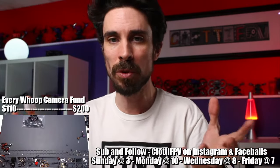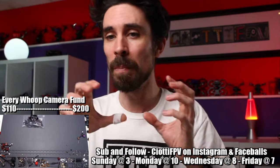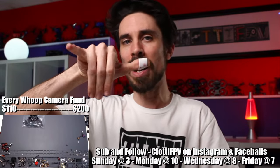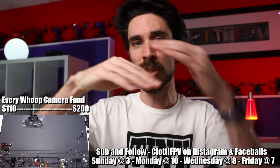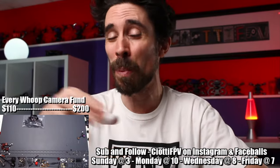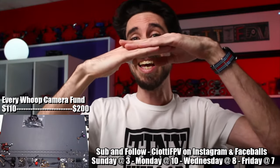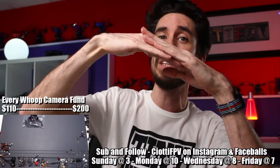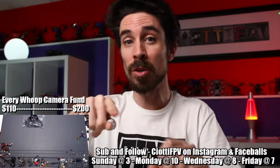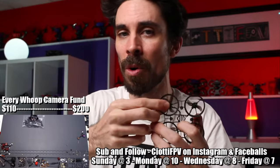One of the PID loop's jobs, I mean, technically it's the filtering's job, but when too many vibrations get in, the PID loop doesn't necessarily understand what those vibrations are, so it's going to try to fight against each one of them. The vibration goes back and forth, and the PID loop is running at either 4 or 8,000 cycles per second. When it gets each of these vibrations, it's going to speed the motors up on one side and brake the motors on the other side. Then when it vibrates the other way, it does the opposite. So it's constantly spinning these motors up and down and up and down to fight this constant vibration, just because your prop or your motor is bent.